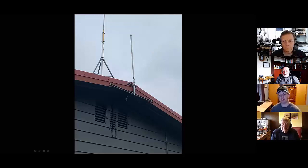One of the big concerns for this site was whether we were going to have any interference with the fire frequency. To my knowledge, they're operating at about 155.1 to 155.6 and on up, in that 155 megahertz window. And in our normal application for this particular site, we're at 144.930. So we tried to create as much vertical separation as possible to ensure that we weren't going to have any issues. And so far, through all our testing, we've been okay. So that's been a good success story there.